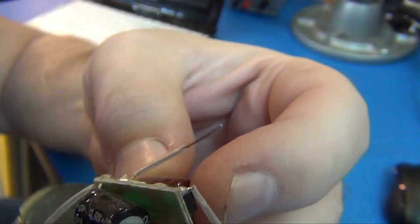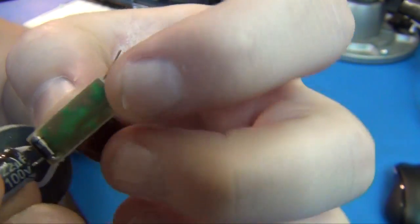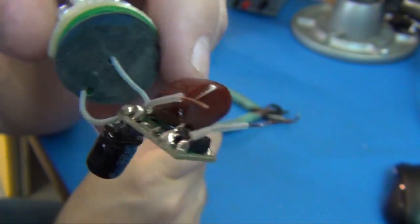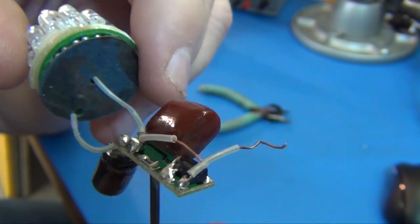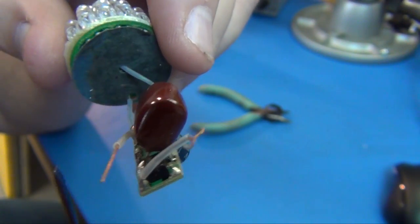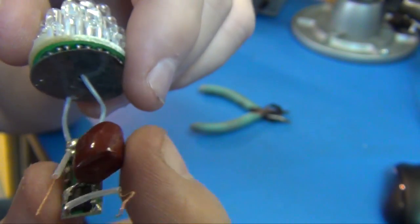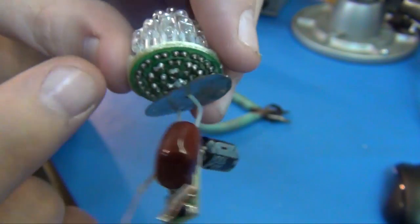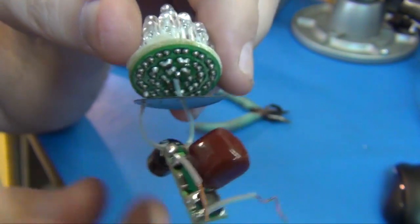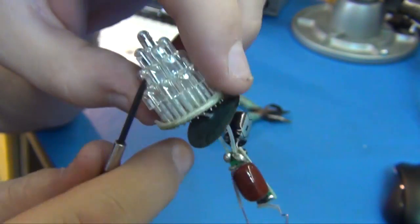And then we have another capacitor around the bottom. It's kind of hugging a diode too. There's a diode right there. So obviously it's basically doing a bit of a rectifying, half-wave rectification, I would say. And I'd have to look up this chip and this resistor. But as long as the current is really low relative for this pack of LEDs, it should be fine. I'm going to see what it takes to light these guys up.